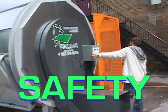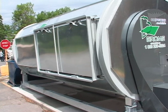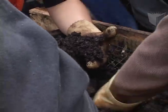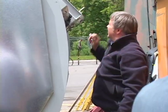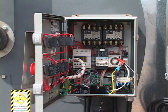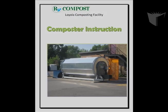In order to ensure your safety when operating the composter, make sure you follow all safety guidelines. When mixing or transferring compost or wood chips, wear a dust mask. Wear gloves when manipulating the compost and wash your hands after. Stay away from pinching zones when the drum is rotating. Do not go between the composter and the lift when the lift is operating. Ask an electrician to power off the system if you need to access the inside of the control panel. Always lock the door of the fence when leaving the area. Please read the instruction manual thoroughly before starting operations.